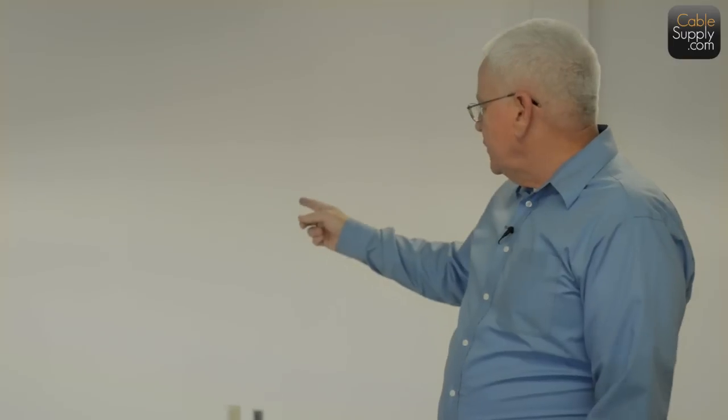So usually what happens is when you're inexperienced, you do this thing in a circle where you keep track of the cables and you're going to waste time. It's just a waste of time. Don't do it. And sometimes customers request that. The problem is, what happens if between cable one and cable two, 6 months from now, they want another cable there? And so now you have what? It's out of order. It doesn't work.